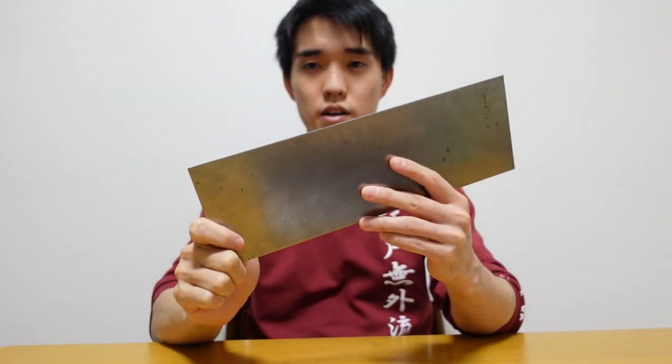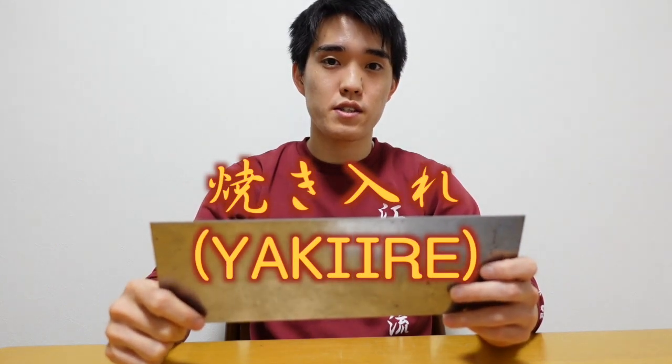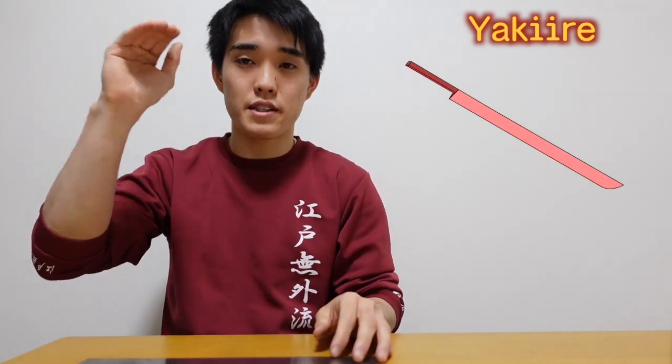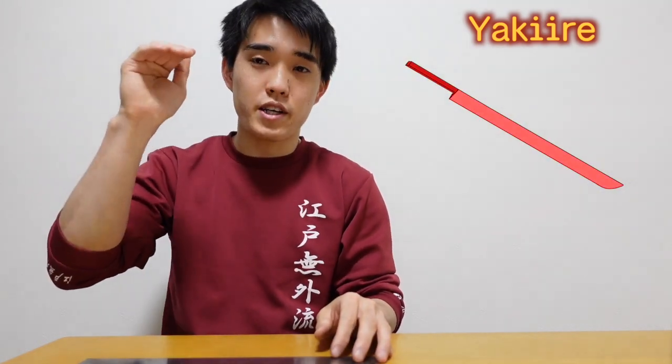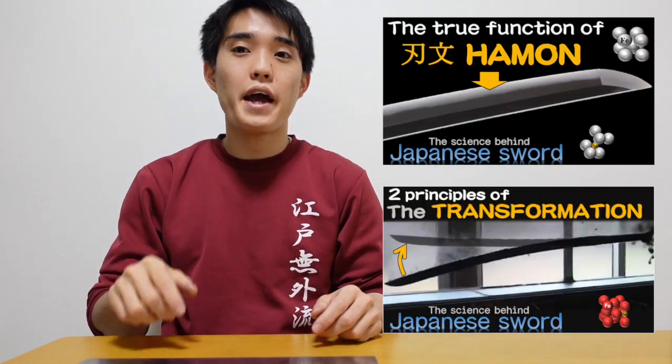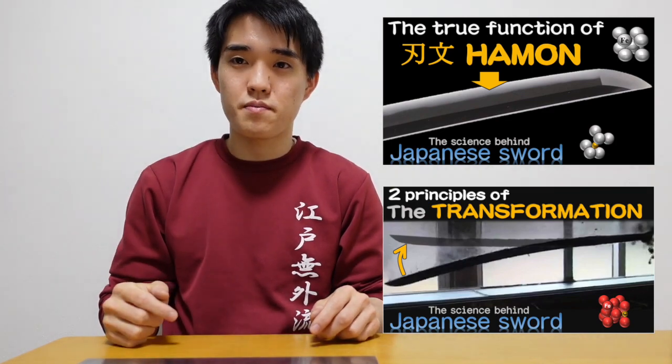But the problem is how I can imitate the part of hamon with this material. I will use the same process as Japanese swordsmiths use for making Japanese sword, which is called yakiire in Japanese. In yakiire process, a steel will be heated up until it is red and immediately cooled down into the water. For more detail, please check our previous video. I included the link in the description.